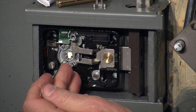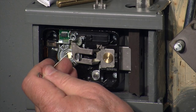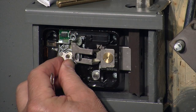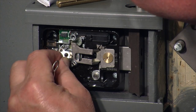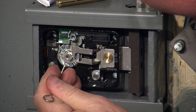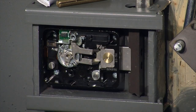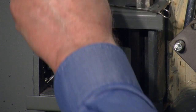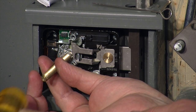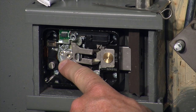In that position, I can see I nearly have alignment of the spline keyway in the drive cam and the spline keyway in the spindle. So I rotate the dial just a little bit to get better alignment. Now I can only insert the spline key in one orientation in order to line up one of the two openings with a small drilled and tapped hole in the drive cam. Once I've pushed it in as far as I can with my fingers, I take this piece of spindle that we cut off earlier, use it as a nice soft punch, and using a lightweight hammer, I seat the spline key flush with the top surface of the drive cam.